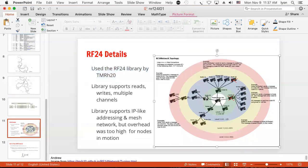But what's nice to know is that even if you have a relatively short range, if you have a number of nodes spread out throughout a sensor mesh, you'll be able to use those to store and forward over a longer and longer range. And it adds a lot of value to the network to know that you can get to any one node from any other node. But there are certain nodes that'll be critical, like this one, which is X'd out, which would keep you from having access to the others. So if one of these nodes goes down, it could take down a whole branch of your network.